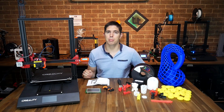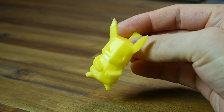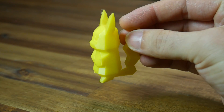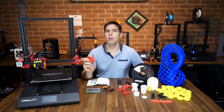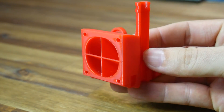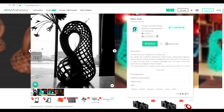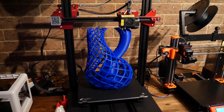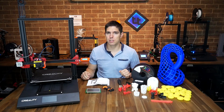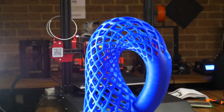To verify further, I printed a low-poly Pikachu from Flowelistic, one of my favourites that I use to benchmark between printers like a 3D Benchy. Save for some very wispy stringing between the two top ears, it was a very nice print with very consistent extrusion. I also prototyped a modified Hero Me mount for my Ender 3 direct drive kit, and this printer did a fabulous job making it accurately. Then I tackled a Klein vase from MyMiniFactory — about two and a half days to print. Apart from one section where the plastic didn't adhere, and some minor stringing, it looked fantastic and was a good testament to the printer's reliability on longer prints.